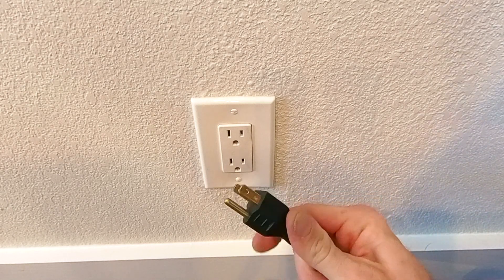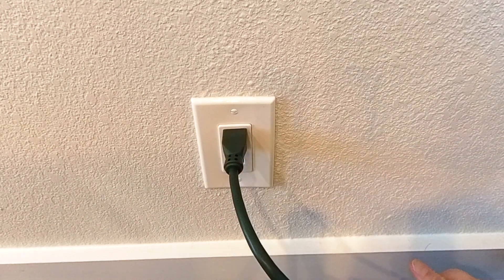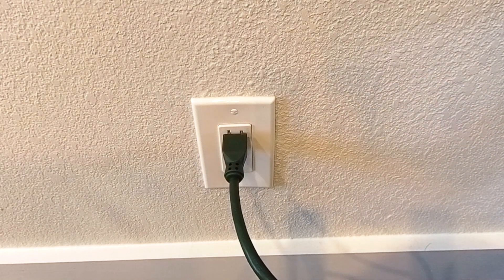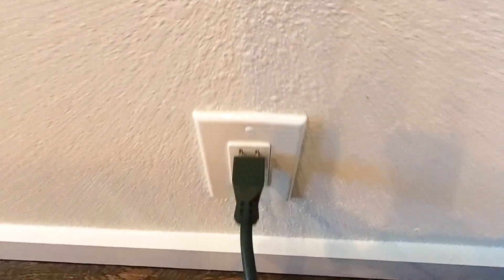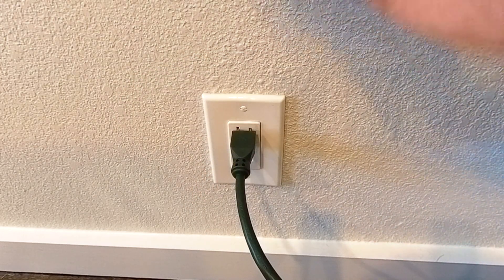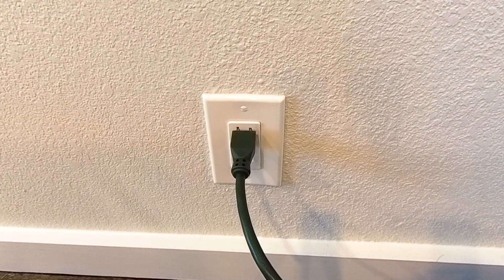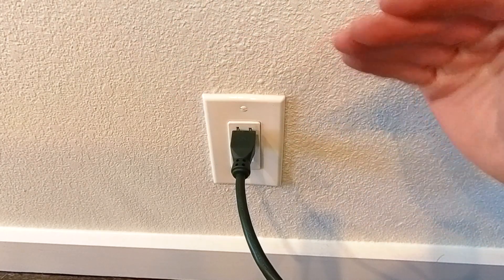Here's a three-prong plug just like you've seen before. Now if I plug this in just like that, no consequence — it just operates as normal. But if it was tripped over or someone was tugging on it just a little bit, and it was kind of like that — we've all seen this — and whatever device is plugged in is still working. The two prongs are exposed there. If you have a desk right up against it and there's a little gap, and you slide a paper clip all the way to the end, in theory — granted it's a small possibility — there is a possibility it could fall and land on both of those. Perhaps a household key, something metal, maybe metal utensils in a kitchen. There's a potential for it to fall on top of that and connect negative and positive together.